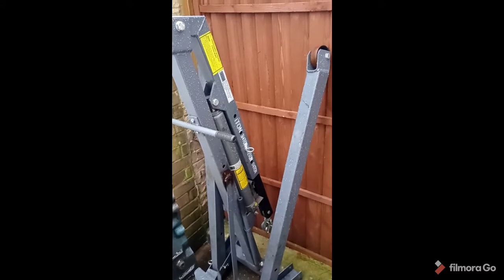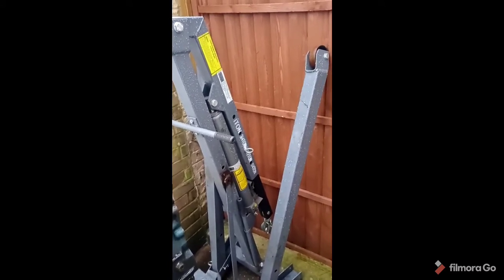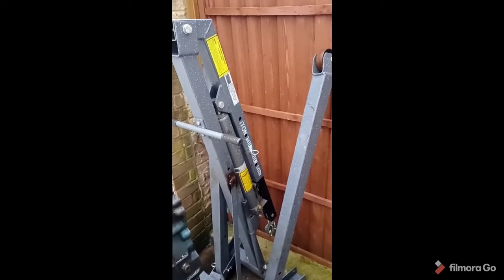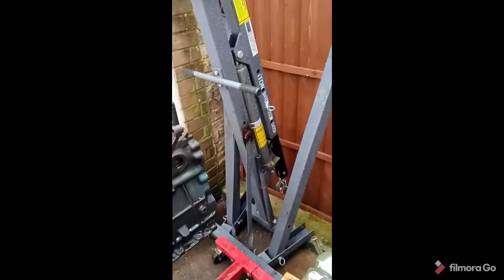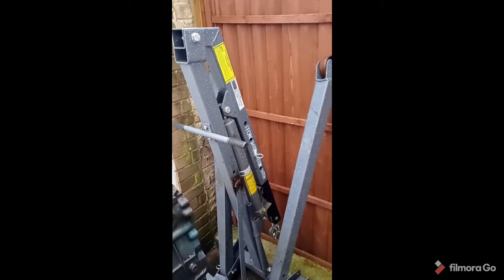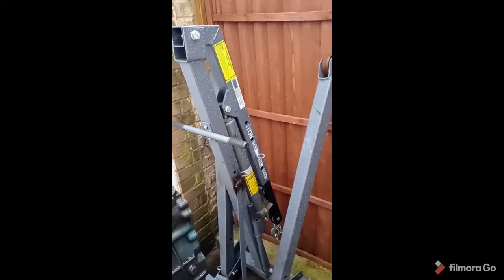I've made the mistake before where I needed the reach. I've had it on its last setting, 1/4 ton, and the whole crane with the engine suspended tried to tip, and I've quickly had to get someone to stand on the back to balance it out. So I try and keep the arm on this 1 ton crane no more than half extended.